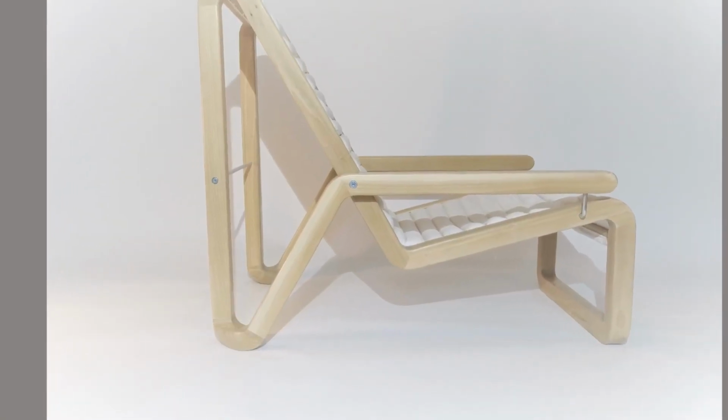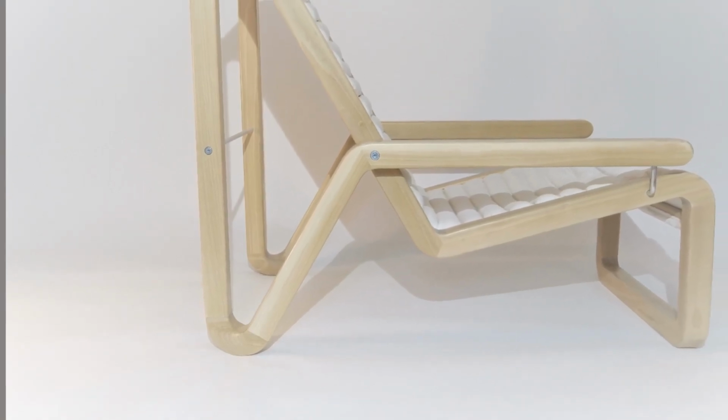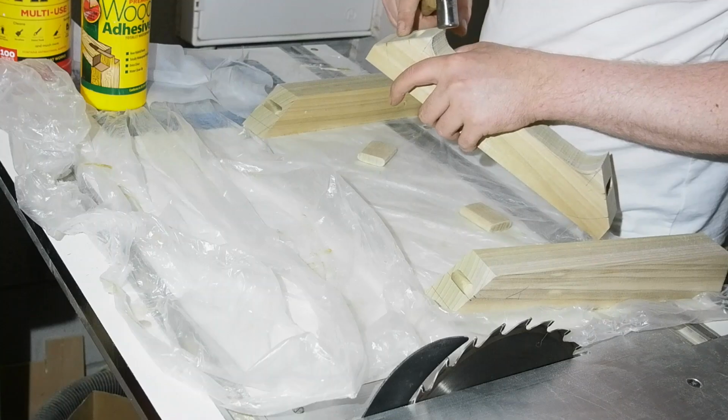The chair actually has double mortise and tenon on every joint except at the rear foot. These have the single floating tenon, albeit with a 100mm screw through the centre. The screw is there to pull the joints together, as being the final joint on the assembly, clamping these curves and angles, which are offset at that, was nigh on impossible. This method worked great though. Back to the stool then.